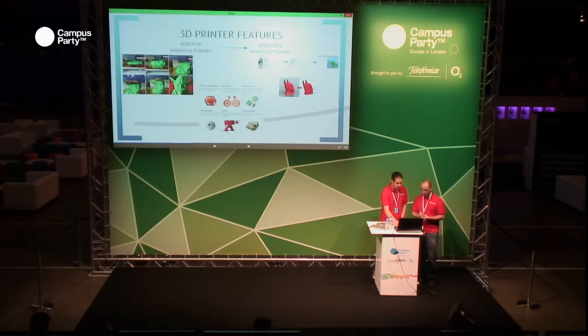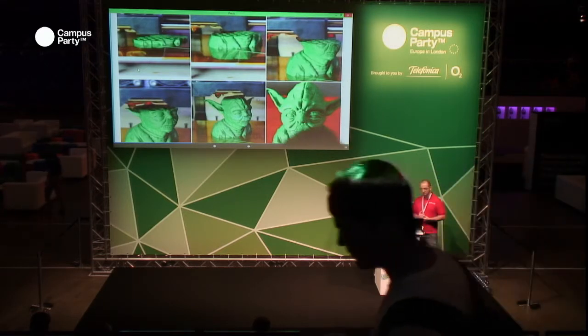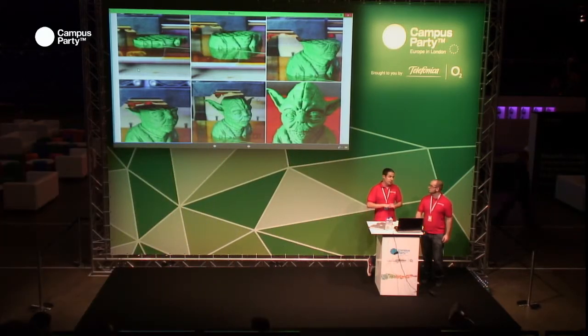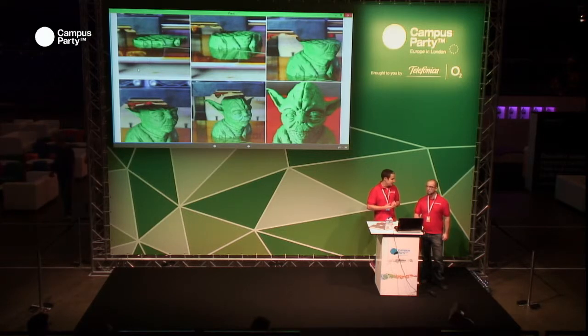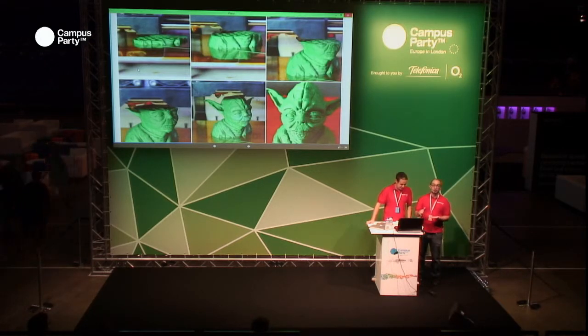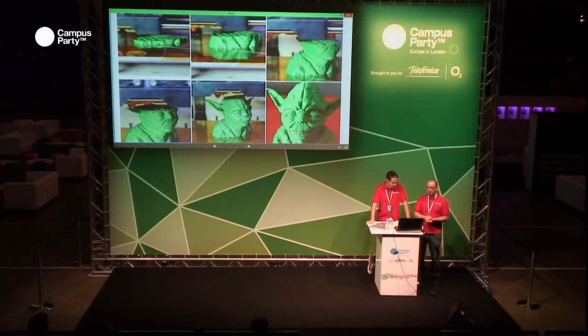In this keynote, we will speak about the heated bed. The heated bed is the place where you print the figure. You build the figure at 240 degrees Celsius in order to make the material melt, and then you have to put this material on a hot surface. If the bed is cold, the plastic bends, and then the figure will be warped. So if you are using ABS plastic, the surface must be hot. You can use a heated bed, and then when the plastic melts, the surface is level.